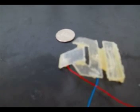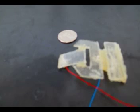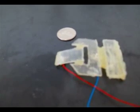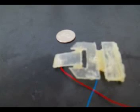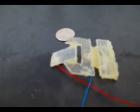Here we demonstrate a robot walking with an inchworm-like gait. It also only uses a single piece of shape memory alloy for actuation. A quarter is placed for scale. These results confirm that this process can be used to rapidly prototype cheap and robust millimeter scale robots.